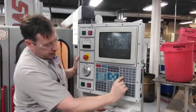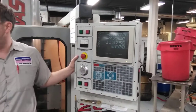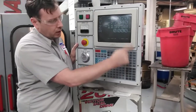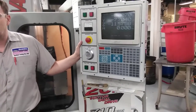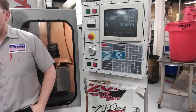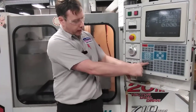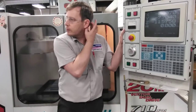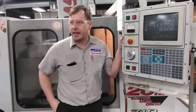Jog Lock changes from the jog numbers to the feed rate numbers across the bottom. If I press this one, it goes 100 thousandths per minute; this one is 1 inch per minute; then 10 inches per minute; then 100 inches per minute. Our feed rate was 8.2 — so which one is closest to 8? Ten — but 10 is still too fast. So use the overrides: we can reduce the feed rate 10% or increase it 10%. 10% of 10 is 1, so that drops it to 9. Do it again — feed rate of 8. That's close enough.